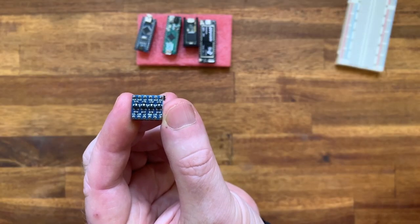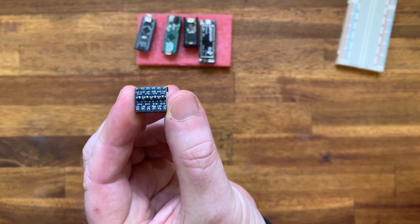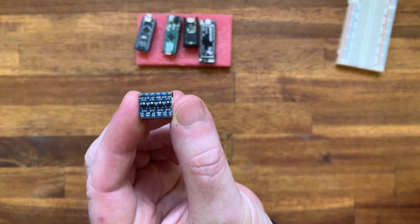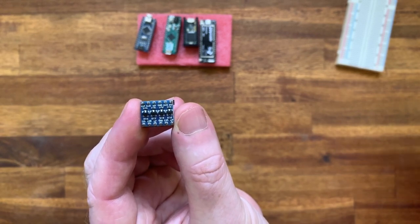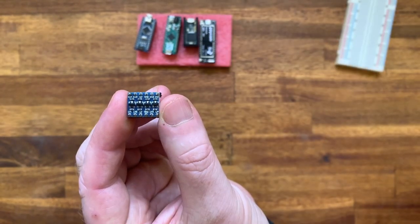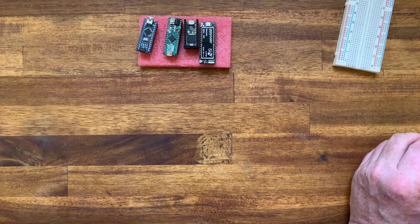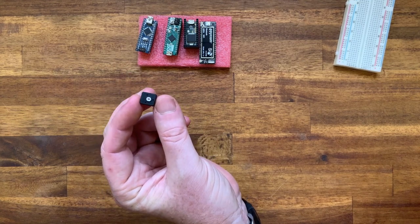These level shifters are very interesting because they're very simple to use. Essentially, we have two voltages on it. We have a high voltage and a low voltage, and it's bidirectional. We can put an input and an output, and this one has 4 level shifters in it, but it can only be used for digital signals. For analog inputs, we could use a simple voltage divider.